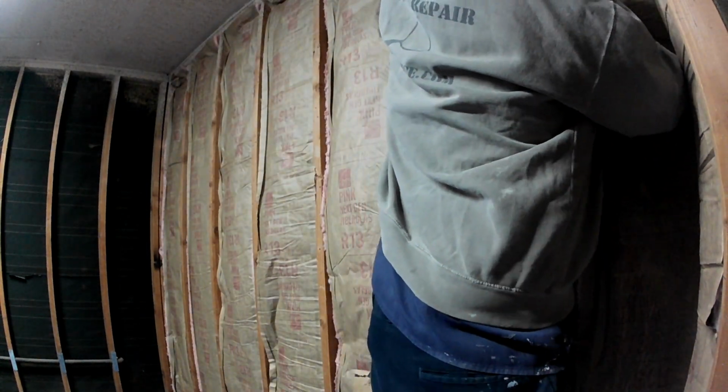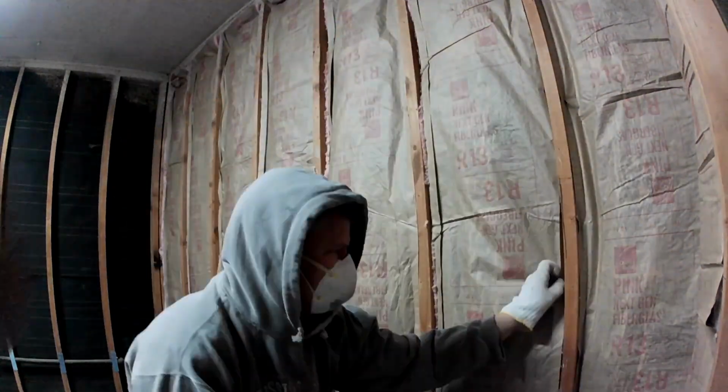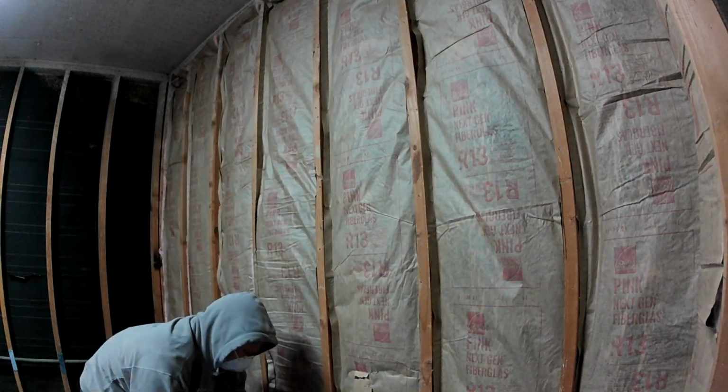Of course, the electrician, the plumber, the gas guy, they should have done this. If I go into a job and I see it, I let the homeowner know that it needs to be done, and I offer the service of hammering on these plates for an extra cost. No problem. But first things first, double check all your framing. Any nails, screws, get them all removed. Make sure it's all framed correctly. Metal brackets, everything in place. Once the framing looks good, then you can do some measurements and see how you want to lay out your sheetrock.